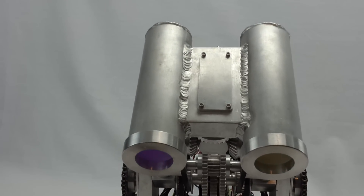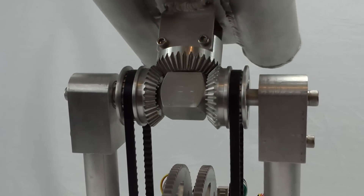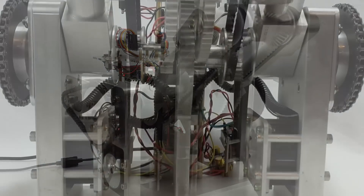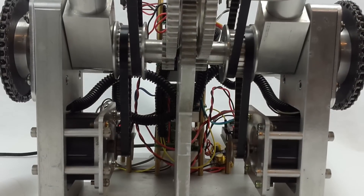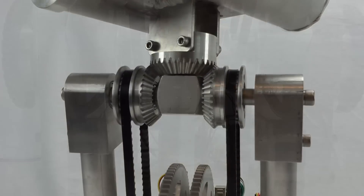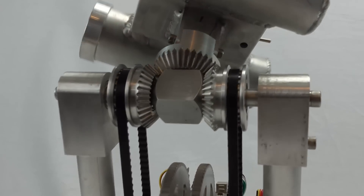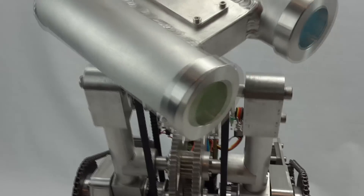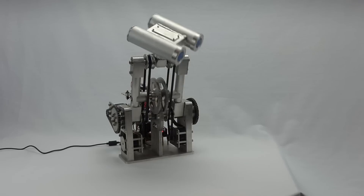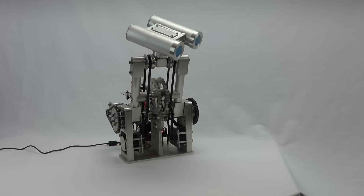The control software — he's run off of stepper motors and regular cheap eBay stepper motor drivers. The software is an Arduino running Teacup software, which is 3D printer software. So this whole mechanism thinks it's a 3D printer — actually, two 3D printers to be specific. But I'm sending it just literally X, Y, and Z coordinates from a third Arduino, which is the host Arduino sending out commands to the other two. Between the X, Y, and Z, he can move in all of his little directions. If the belts go together, he looks up and down. If the belts go opposite, he turns. And then, of course, the main arm can go up and down.